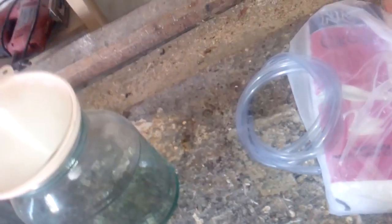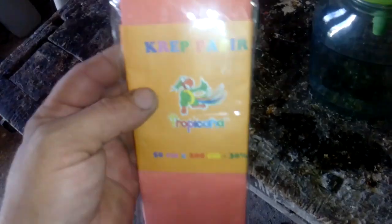So what we do next is to decant this water and filter all that black powder. I just want to show you what we use for filtering. You know what this is? We use crepe paper for the filter - my friends told me about it and I just want to try. This is crepe paper, not for real crabs, but decorative crepe paper used to make flowers for weddings and other stuff. We make a filter from this because it catches powder really nicely.